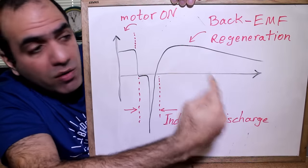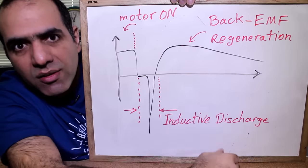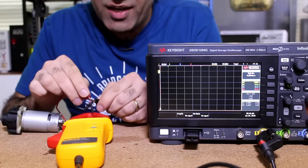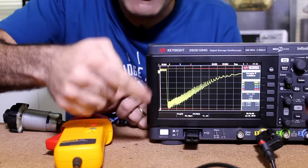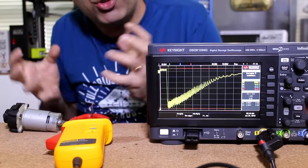The fuzzy noise is due to commutator switching, so the back EMF voltage goes down as the motor stops. This can cause trouble, or we can suck the back EMF energy out and use it — which results in the motor stopping faster. That's called regenerative braking. I'm running the motor from my power supply and if I short the contacts it draws around 70 amps from the motor, sucking the back EMF energy and stopping the motor quickly.